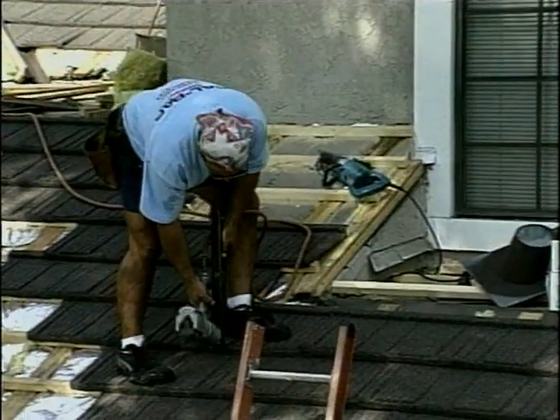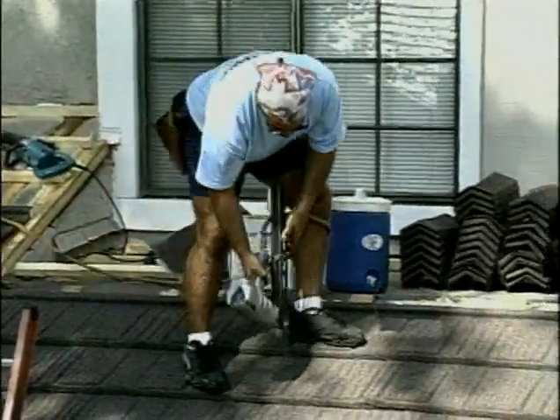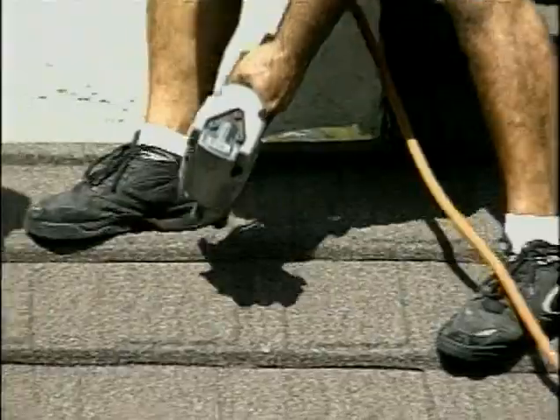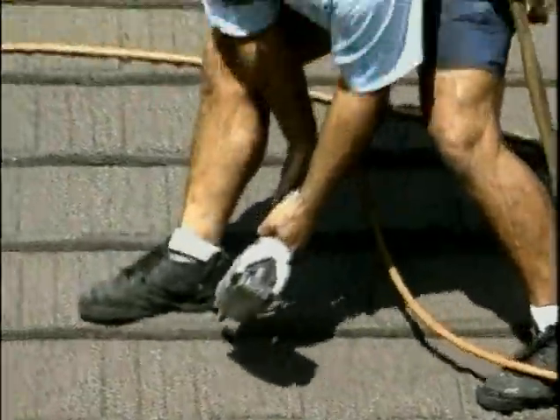How do you attach this type of shingle through the roof? I don't see any nail holes. This one is attached through the nose and actually attaches into a batten and counter-batten system. So in order to get the product off, you've actually got to shear the nail — much like a rafter clip, because you have to shear the nail instead of just pulling it out of tension.